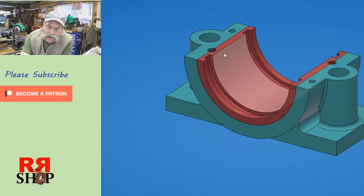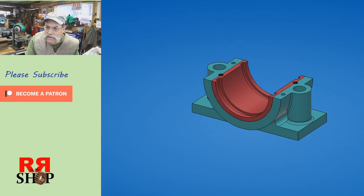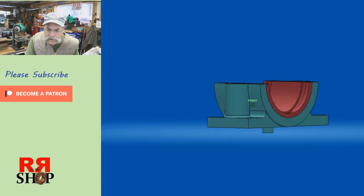You can make this a little bit bigger so that it kind of presses in there a little bit. We'll see how that goes. It's probably easier for me to just make them fit real well and do the set screw and lock them in. I might put in locator pins. That's what these holes are. I'm not sure if I'm going to do that or if I really have to. I probably don't have to, but I just modeled them in here just to see where I could do it and how to do it.